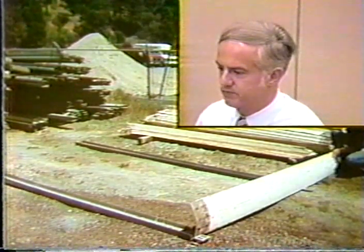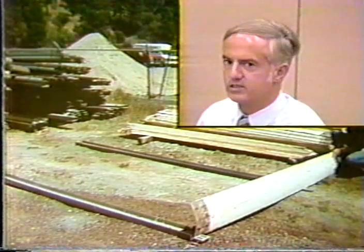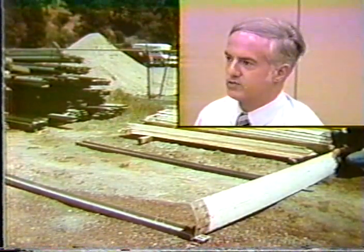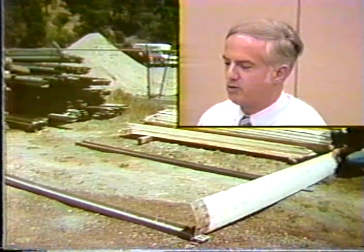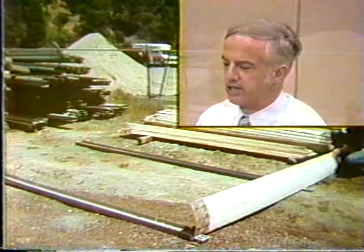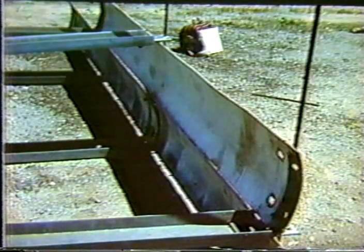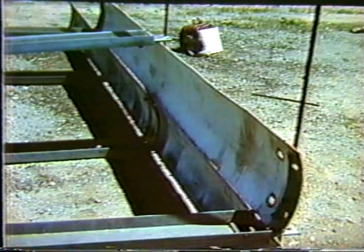And so what we did here was try to devise a system that we could use the salvage guardrail and these salvaged rails from the rub rails and come up with a little retaining wall system, and this is what we came up with. The rub rail at one end had the anchor block, or a little connecting plate, and through that connecting plate one could place a vertical bar, and then against the bar we could use this old guardrail.